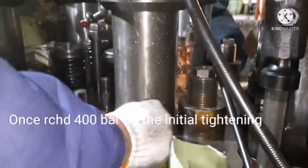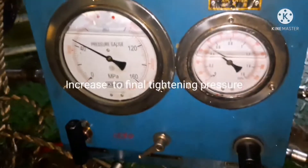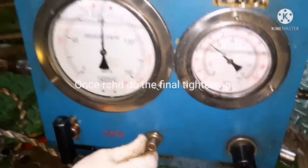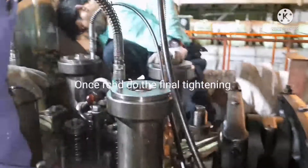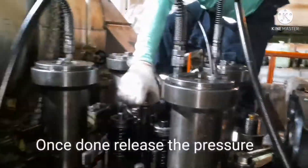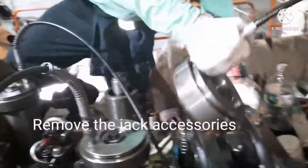As a general rule, if the final tightening pressure is, for example, 1500 bar, go to 750 bar for the first stage and 1500 bar for the second. Now I am doing the final tightening at 860 bar, increasing the pressure until it reaches the target, then tightening all four nuts. Once tightening is done, release the pressure by opening the return line — same procedure: tighten the jack to ensure no oil remains inside, then remove and secure the jack.